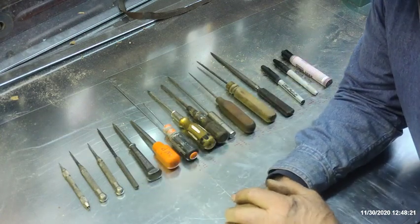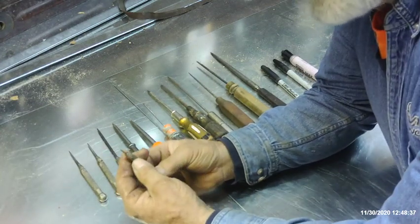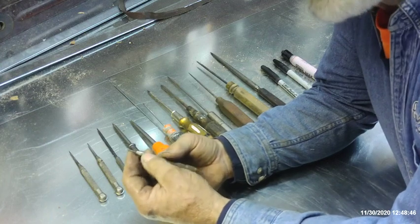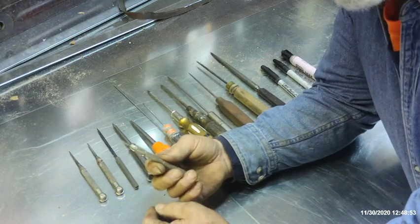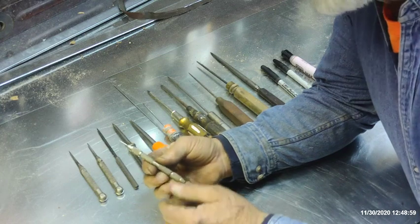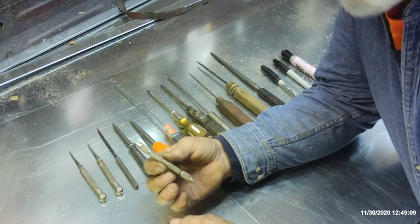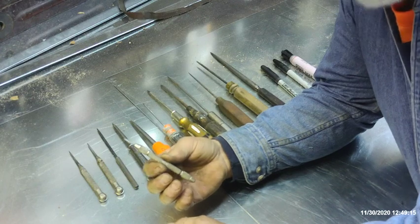You can see there's quite a number here. This one is currently in my toolbox, it stays in my toolbox. This guy right here is actually a pin vise — a very small Craftsman pin vise. You open this up and the tip will slide in and out. It'll hold up to possibly as much as a sixteenth of an inch replaceable tip. I'm pretty sure Craftsman still has those. This is probably for a metal worker's layout where you use bluing compound in a machine shop, and you use this scribe to make your marks on your blued material. It's also a dual pin vise; there's a second one on the other end.